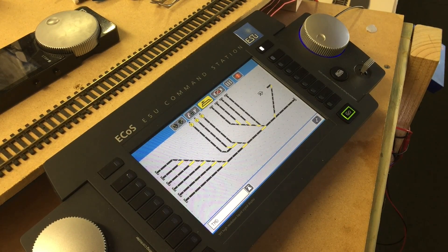It should work with any DCC controller — I'm fairly certain that's the case. Just take note of your addresses: address 225 is the default address for the Heljan turntable, so try to avoid programming any points or other accessories to that address, otherwise you're going to have the turntable going berserk while you're trying to turn on a light or switch a point.